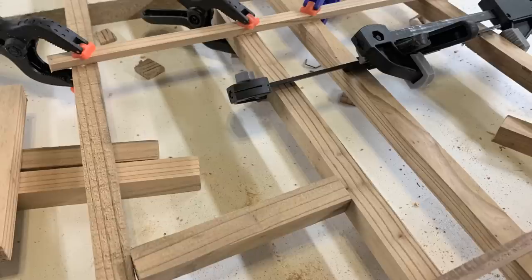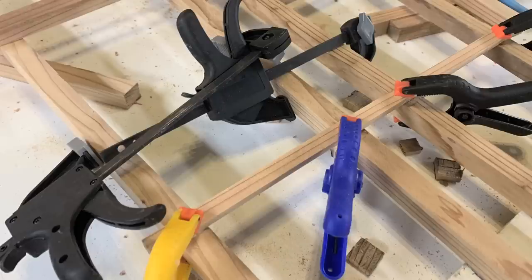Man, I mean, I've heard of getting a grip, but what's with all the clamps? Well, because like an idiot, I made my jig short. Off the end of the jig, the posts are trying to warp left to right and front to back, and so I had to use a variety of shims and clamps to pull everything into square as I bolted it together. Wow. So I wouldn't have had to do that had I just made my jig the proper size.